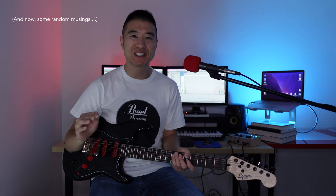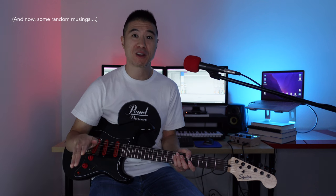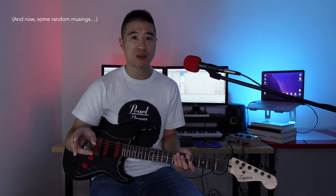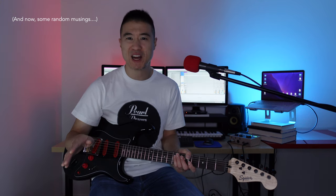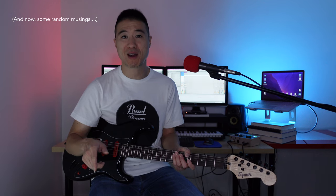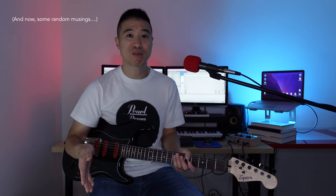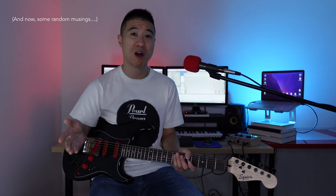Part of the challenge comes from working with tiny parts. For example, humbucker wires are so damn thin and they're difficult to strip the insulation off of. Lugs on push-pull pots are also tiny. You put two and two together and it becomes a challenge to work with all these tiny parts in a small space, even for someone with small hands like myself. And when you've got multiple functions across numerous pots and pickups, that means more tiny wires, more tiny lugs, more soldering in tight spaces, and more wires to troubleshoot if things aren't working as expected. So keep all of this in mind.